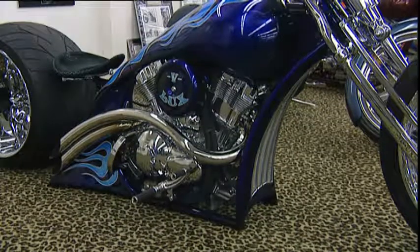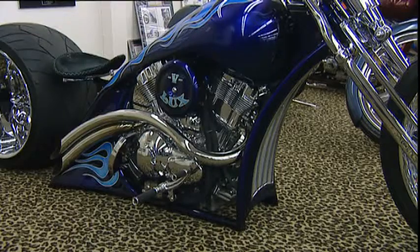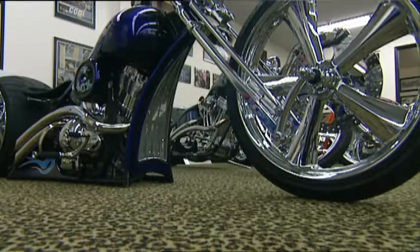This particular motor, when I got it, was a stock motor, and I took it apart and had it polished. And then some pieces chromed on it, so it makes the motor look a lot nicer. On the front of the bike, there's a grill, and in between the gas tanks, I made an air box that channels air like a velocity stack into a plenum in the throttle body. So it's all hidden, but it's all stuff that has to be there for the motor to work.